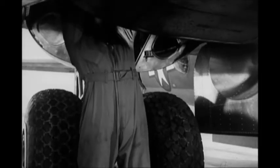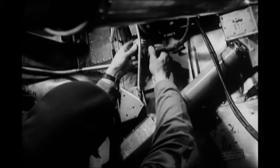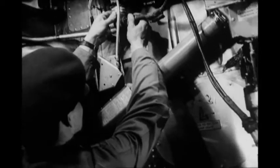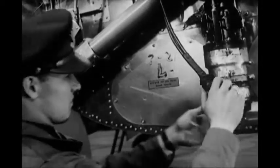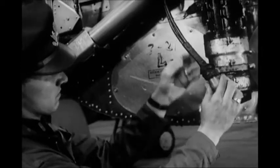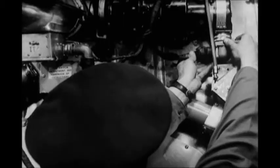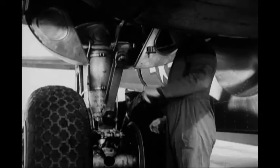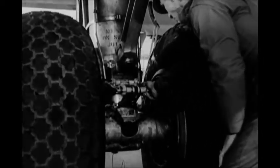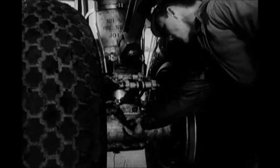Inside the wheel well, the co-pilot examines the wires, connections, and switches. He makes sure all the cannon plugs are on tight, paying particular attention to the plugs on this motor, which opens and closes the nacelle doors, and also to the plugs of the normal and emergency landing gear motors. Then he turns around to examine his side of the strut. He looks it over and inspects the brake lines, making sure that the hose is not chafing and no fluid is leaking.